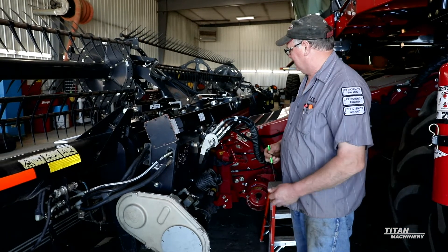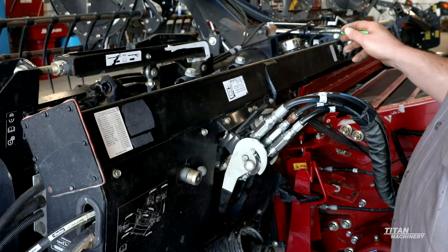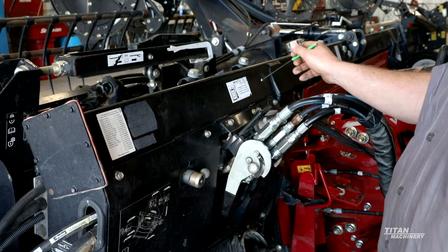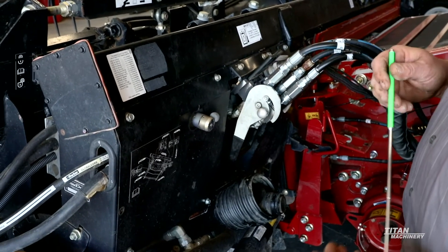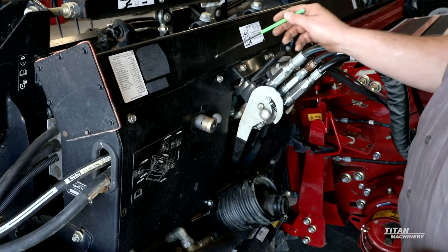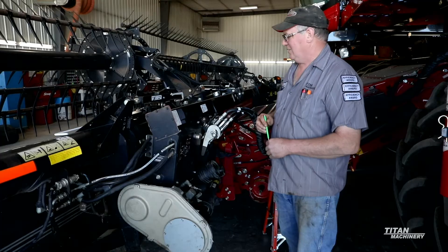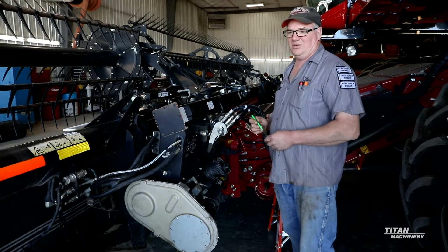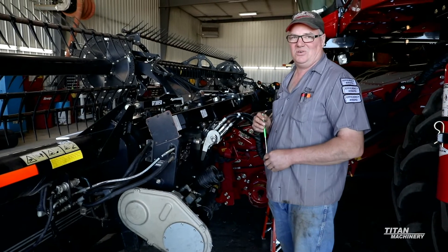Changing oils on your headers. Your hydraulic reservoir is inside of this tube. This holds 15W40 engine oil, and your filter is inside of there. All 2162, FD70, and FD75s take 15W40 engine oil — make sure you use 15W40. The only ones that use Hytran are the new FD100 series. All older ones are 15W40 engine oil.